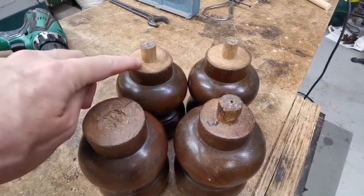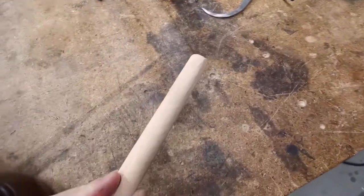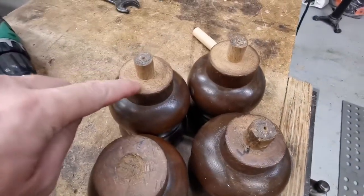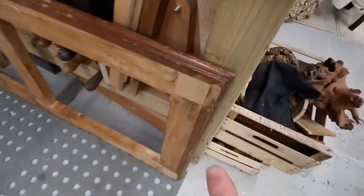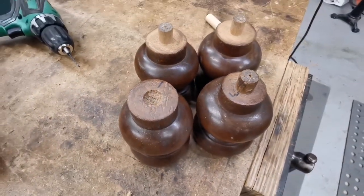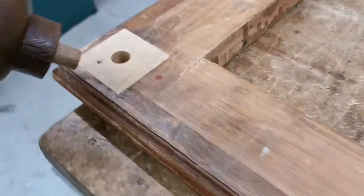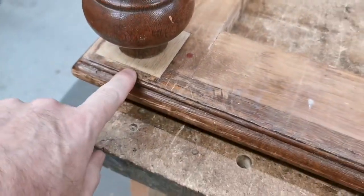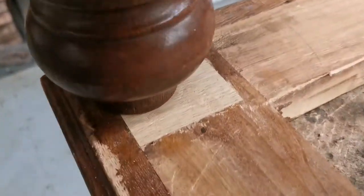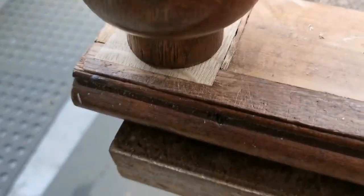Here's the before and after - I've not taken much off. It's gone from three-quarters down to just under 19mm, and that one I've got to drill out and put a dowel in. There you go - that's the difference. The shoulder is going to sit on the pad properly, whereas before it wasn't. Look how polished and shiny it is. Nearly done - that's how tight the fit is and they fit pretty good. The new dowel - bigger hole, that was 19mm, all the rest are 18mm - and that will be glued on.